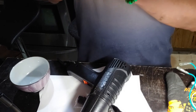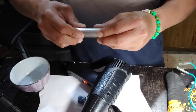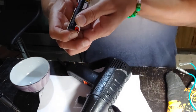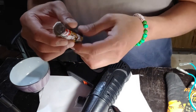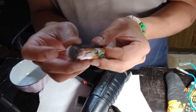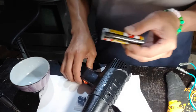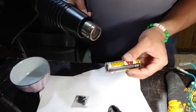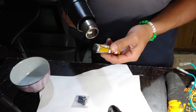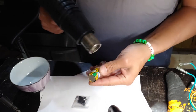Hold on. It's fine. Wiggle it a little bit like that and there we go. What you're going to do is fill it in there and align the heat shrink so you have about the same amount of space — extra space here and here. So I've got some even space here. I'm going to go ahead and turn my heat gun on and heat everything around it, the ends here.